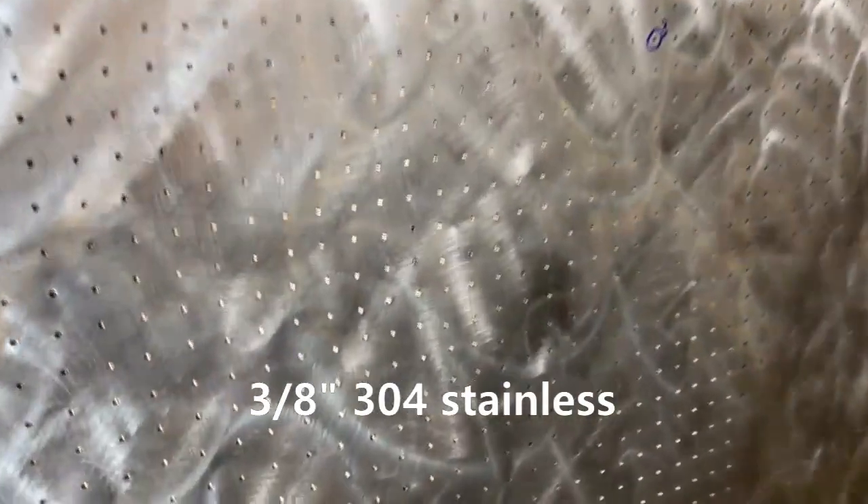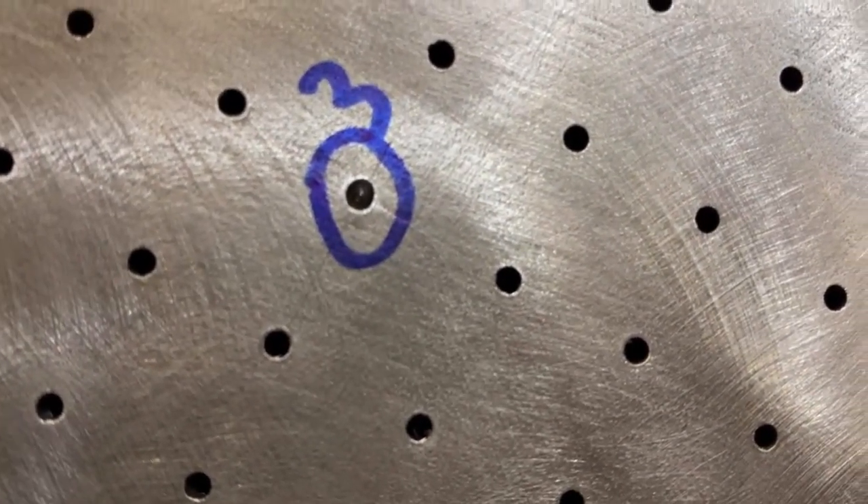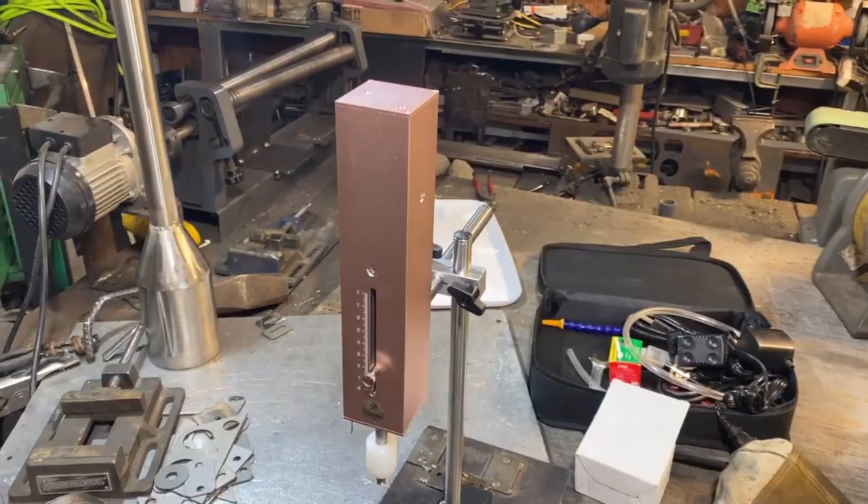There are literally thousands of holes in this piece of stainless steel. I've got a couple of drill bits stuck in several spots, and this job dragged out so long I just couldn't bring myself to charge the customer anymore, so I stopped the clock. The reason I purchased this EDM machine is because I've got drill bits broke off in these holes. We're going to burn those drill bits out and save the day. I had a technique that was getting them out, but if they weren't deep enough to punch through the other side, they were quite a bear.